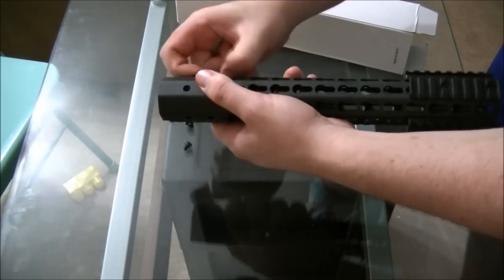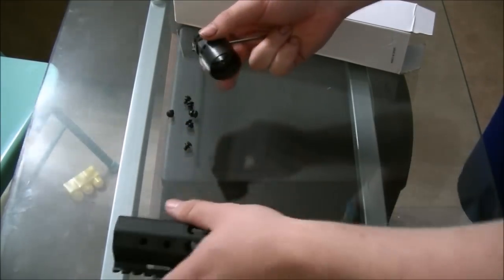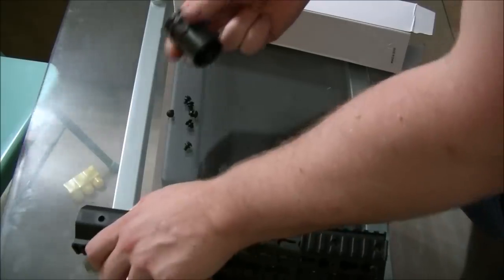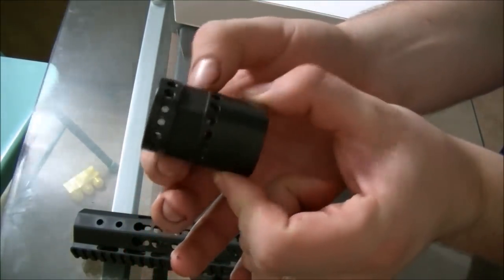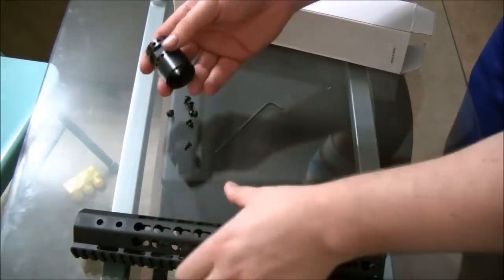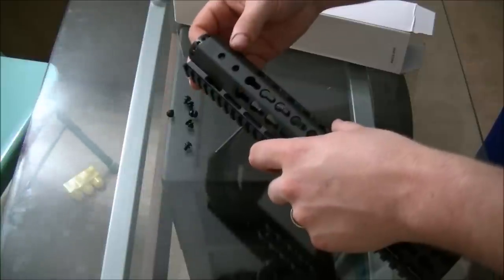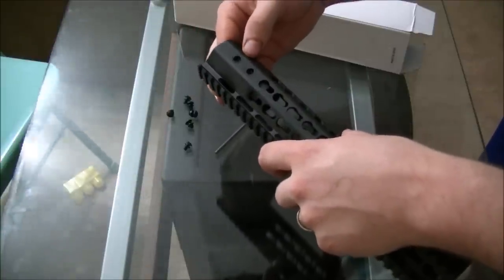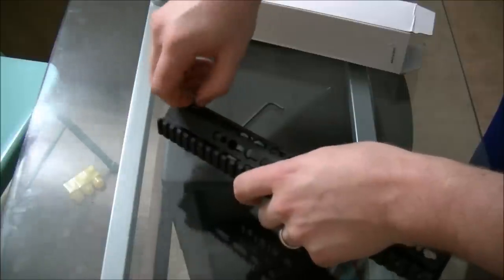Because if you have a barrel nut that's too loose, your rifle's basically not safe and honestly it's kind of useless. So there's the barrel nut — very small in profile, very narrow. This is a super light free float rail. It's a very simple concept, and this kit actually came with some barrel shims to help even it out and make sure everything lined up perfectly. It's a hexagon based barrel nut system. I think Noveske uses a square based, but a 1 and 3/16ths wrench will work on this barrel nut.